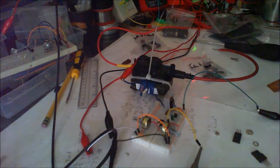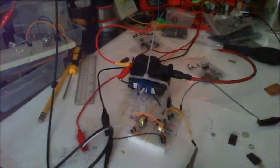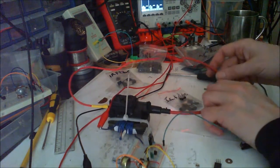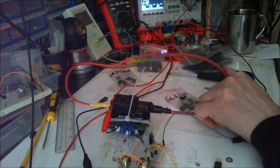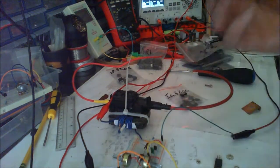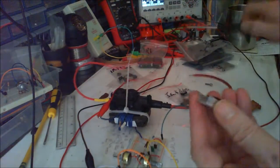I'm going to turn up the voltage a little bit - turning the gate off, plugging back into the big supply, and turning the voltage up to 24 volts. There we go, smack on 24 volts. Everything's still the same - same power, same gate drive - and let's turn that on. It's definitely still better than what it was without the separate supply. So that's the IRF840 in there now.